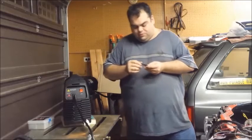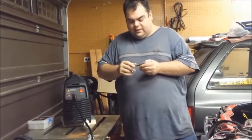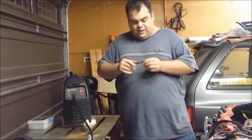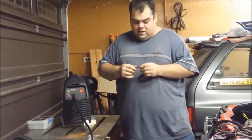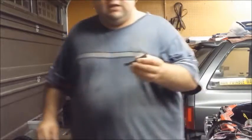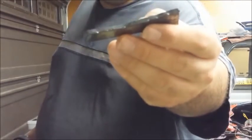The cuts are just super clean. If you can keep your hand nice and steady you can get a nice steady cut. I've seen on YouTube guys using different straight edges to make a clean straight cut. They also have circle cutting devices for help making clean circle cuts and angle cuts. There's a little bit of slag on the back side but that'll come off and chip off easily with a hammer.